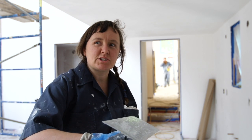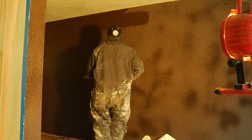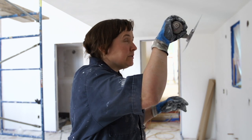You become comfortable with feeling how much weight is on your trowel. You have a straight line on your trowel that gives you that nice line at the ceiling, but you have to go real slow and keep cleaning the edge. Any built-up crumbs will give you a crumbly line, so you keep cleaning it, hold the trowel up against the surface, and only put a little bit of mud in that spot.